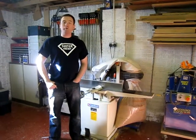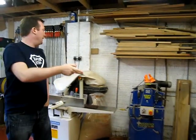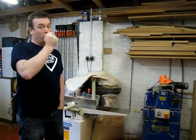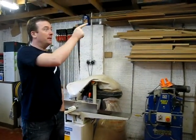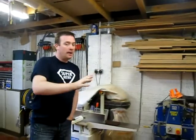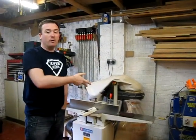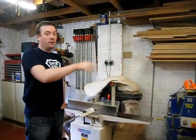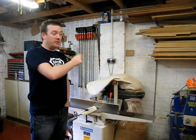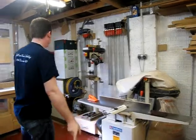I'm Donna Collings, this is workshop video 4 and in this video I'm going to cover workshop electrics. I've got several double plug sockets all the way around the shop on its own separate ring main wired into the fuse box on a 32 amp circuit. That's more than sufficient for most of the tools — nothing is more than 2,200 watts. You never have more than two things running at any one time, so 32 amps is fine. Everything's on a 13 amp socket bar, except one machine which we'll come back to in a bit.